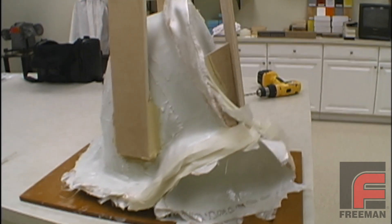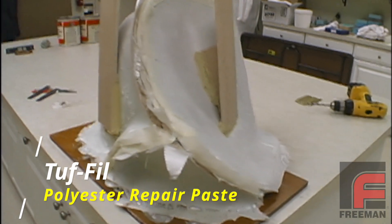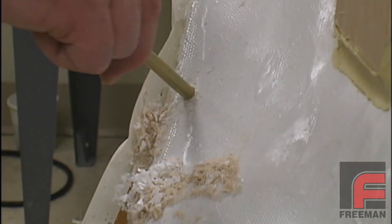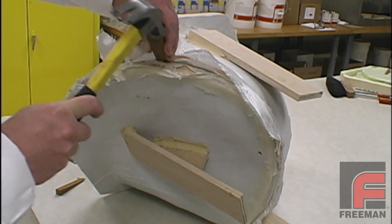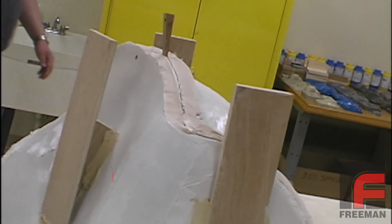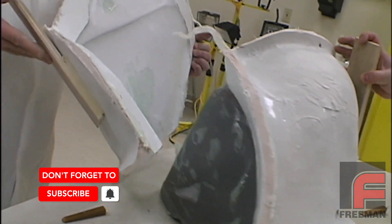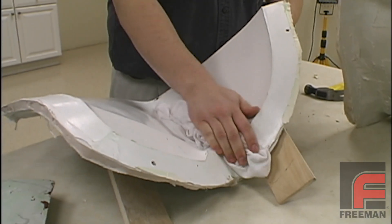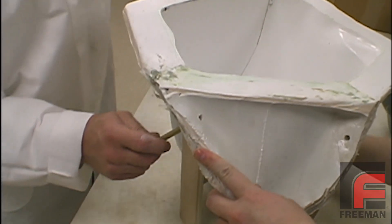Notice the makeshift stands that we have attached to the outside using our tuff fill, so we can later turn the tool upside down. Before we demold, we are drilling holes through the lips of our mold to ensure perfect alignment of our three parts later, and we are inserting brass dowels into the holes. Here we are placing wedges at the parting lines and tapping them with a hammer. Because we followed the proper sealing and releasing procedures, we are able to demold each part cleanly. Notice the green PVA mold release on our tool, which can be easily peeled off and then washed off with water or a damp rag. Since we drilled the alignment pins before demolding, we are ensured perfect alignment when reassembling our tool.